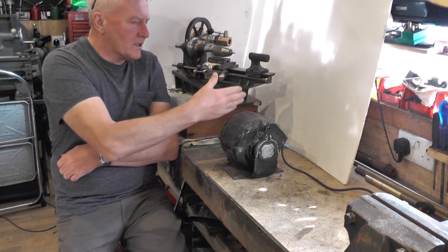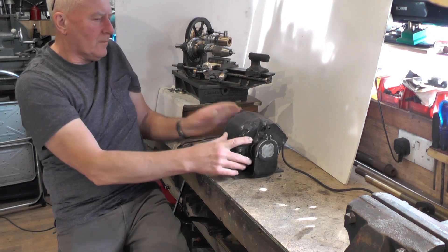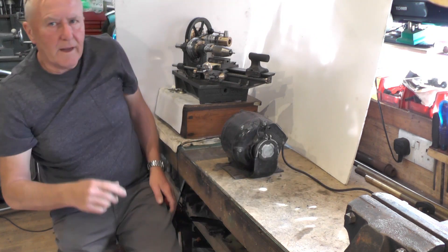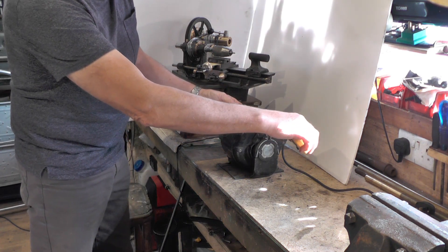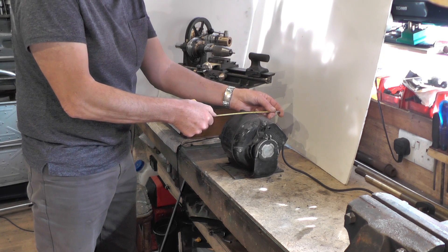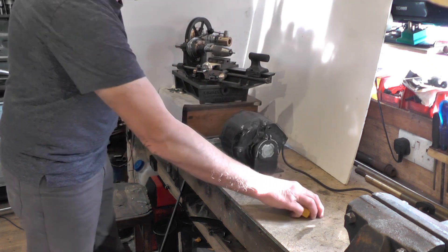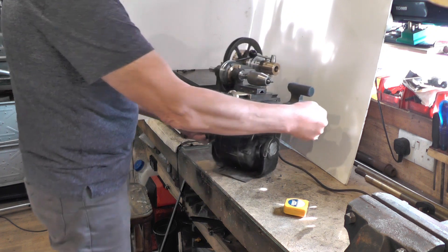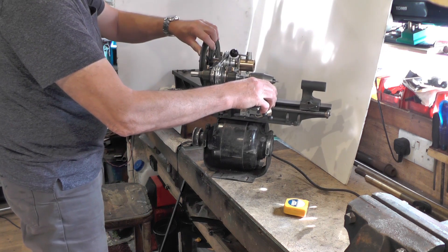So what I'm going to do is just make a stand. The motor will be on one side on a pivot point, and then perhaps at this side I'll put a few drawers or shelves. It's not going to be that big actually — the actual size of it is only going to be 13 inches, or 330mm if you're working in metric, by 8 inches deep or 200mm, and probably 8 inches high, 200mm — so it's only going to be small and compact. Then the lathe is going to fit on the top of it with this pulley hanging out to fit this pulley on the lathe.